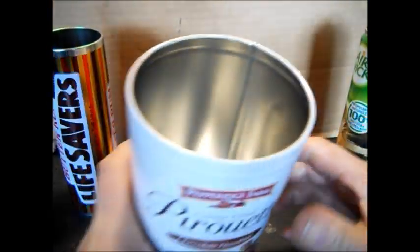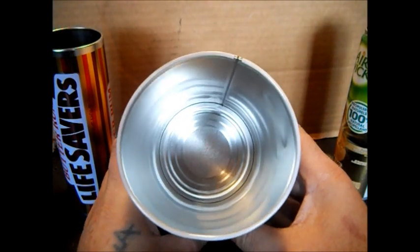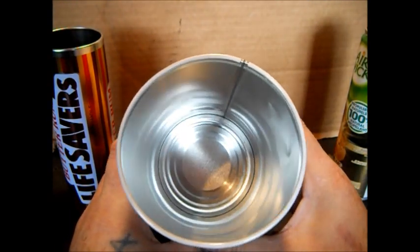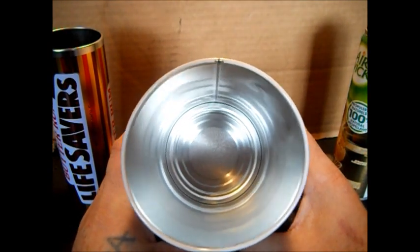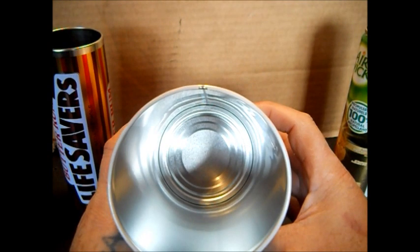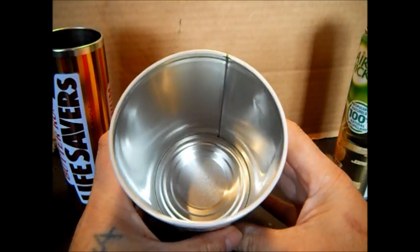What I'll use for insulation — people use vermiculite. If you use dry oil-dry, your natural kitty litter, which is just clay, does work good. I've only seen a few videos on YouTube where they've used that, but vermiculite is what they want for it. For these little projects, the clay oil-dry kitty litter will work just as good.